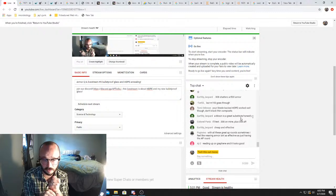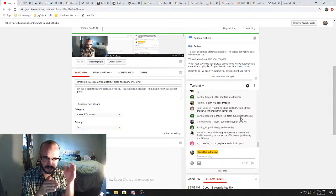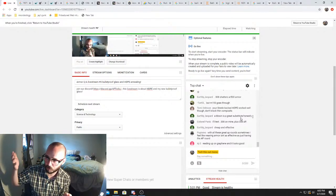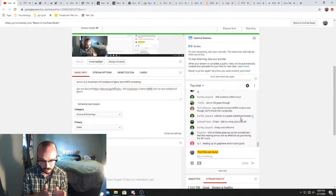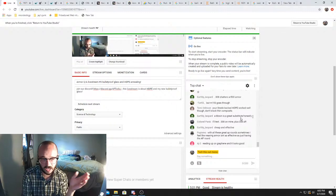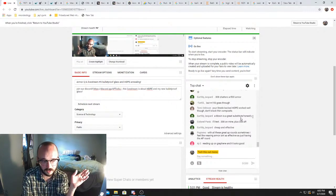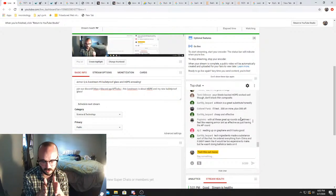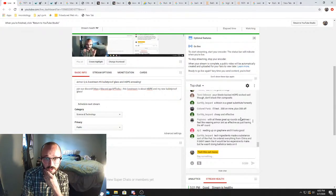There's a lot of variables that I want to continue to test, because maybe this material works, but there's something just slightly better that, once you get it to a certain thickness, performs way better than the counterpart. And also, some materials, when you continue to go thicker, actually have diminishing returns. Just adding another few layers on it doesn't do anything. So understanding why these materials work in tandem with each other is critical to stopping the highest caliber round in the thinnest possible plate that's light enough, that's easy enough to mold, right?